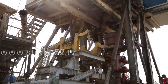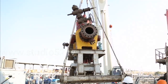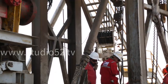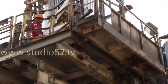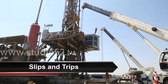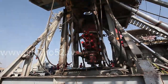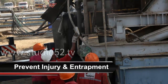BOP has designated lifting points — use them at all times and stand at a safe distance from the load using a tagline. Making up flange connections involves many of the same safety principles that apply to any load, so be sure to observe them. Be wary of other hazards associated with handling BOP. Slip-and-trips occur as the result of bad housekeeping, so keep house. BOPs are made up of separate sections, so use caution and keep hands, fingers, and your body clear of moving parts to prevent injury and entrapment.